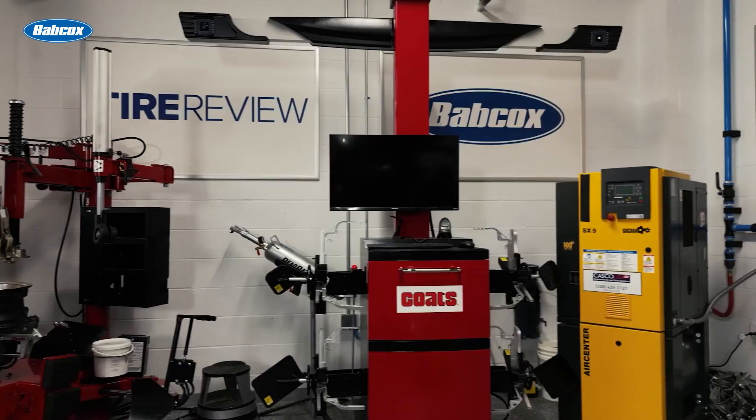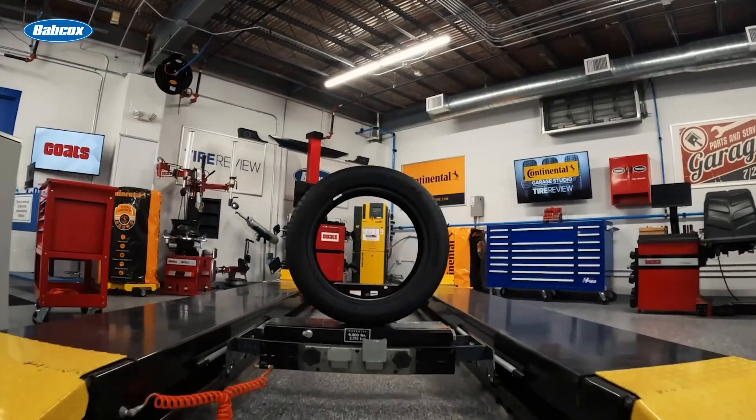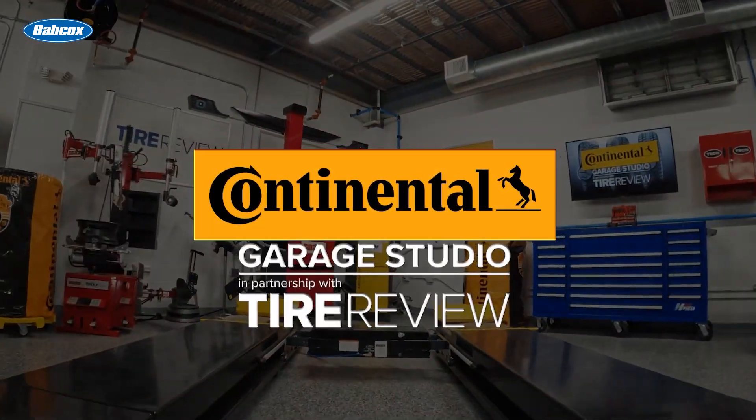That's where a wheel bearing seal comes in. Seals can keep a bearing sealed, but if there's a leak, that's a sign the seal has failed. In this video, let's talk about how to service and install a seal after one has been damaged. The first thing you should know about seal installation is that a seal should always be installed so that the sealing lip is facing the fluid.